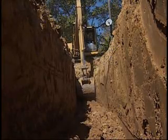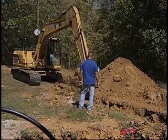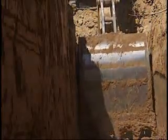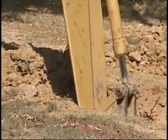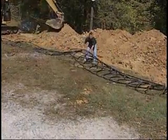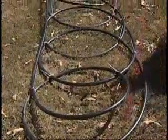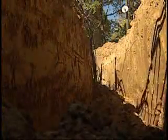You must place the loop at least six feet deep in the ground, with each trench being at least eight to ten feet apart from each other. The track hole bucket is three feet wide, which makes this a good fit for the three-foot slinky loop. Make sure you know where any water or electrical lines are buried in the yard. We have estimated a 65-foot trench for 600 feet of slinky loop. This will vary depending on the length of pipe needed to enter the header manifold. Now's the fun part — dropping the completed slinky loop in the trench.